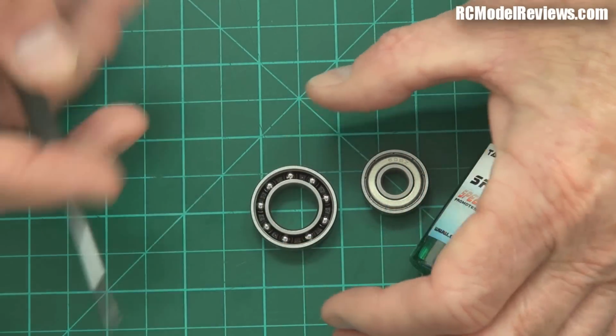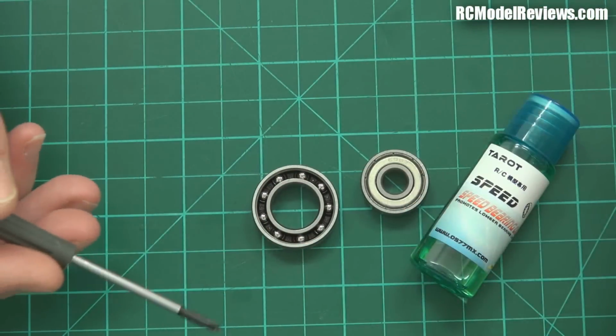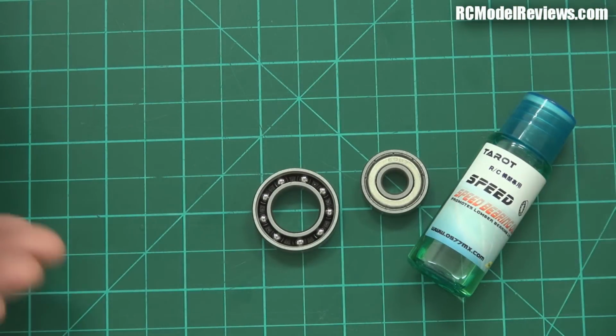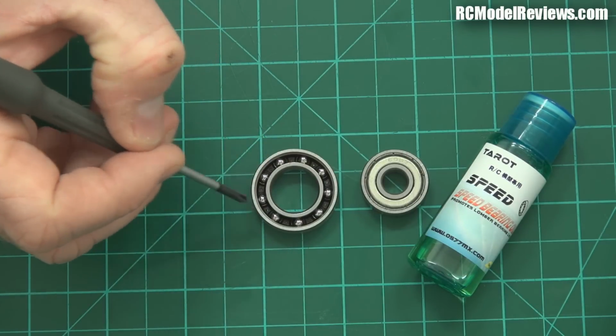around. And what happens is, if the oil is too thick, or if you have too much oil, then a little wave of oil builds up in front of the balls, and eventually the pressure from that wave forces oil under the balls so that they're no longer touching the races. And so they actually aquaplane, they skate across the surface of the race there.